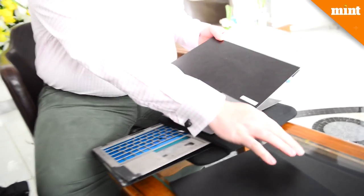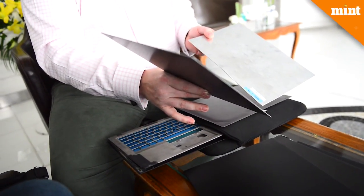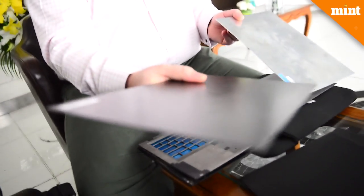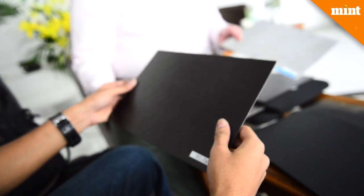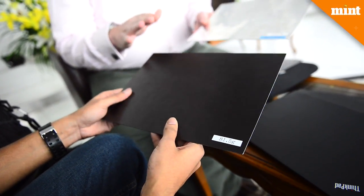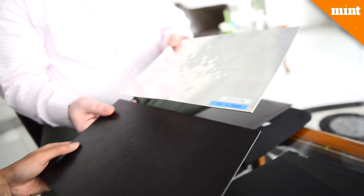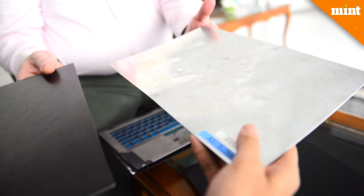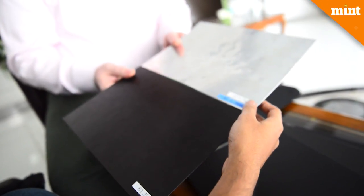This is a slightly older sheet of this generation of carbon fiber — two layers of carbon fiber on top, two layers at the bottom, with a layer of shock-absorbing foam in the middle. It's pretty thin. That's a lot of layers. Now this is aluminum — feel the difference in weight between the two. That's 81 grams here and 210 over there. It's a massive difference, and they're pretty much the same thickness.